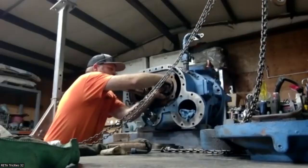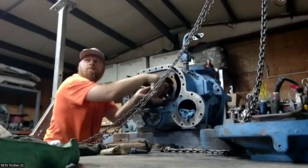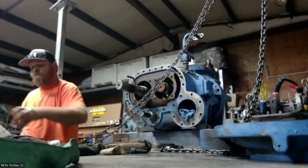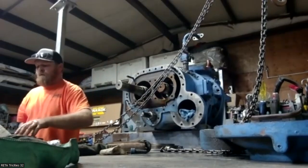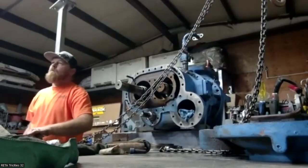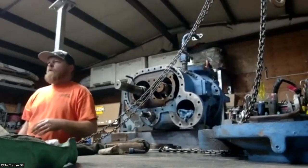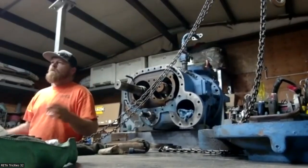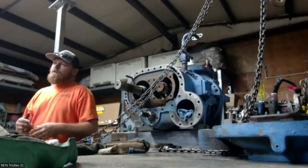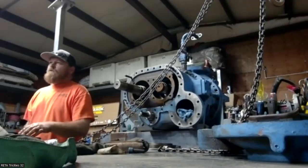So if I have a pretty good maintenance program where I'm doing regular vibration analysis on both of those shafts, how often can I catch a failure before I have to take the compressor out and send it to the shop? A lot of vibration analysis and oil sampling is what all the manufacturers are gearing toward. They're not telling you 30,000-40,000 hours anymore because there are so many variables that come into play. How often is that compressor started, stopped? Is it running fully loaded, moderately loaded? So vibration analysis and oil sampling is your best bet.